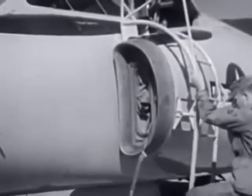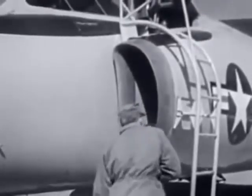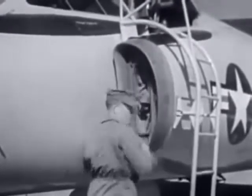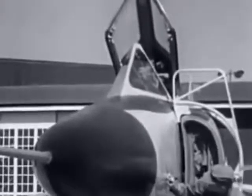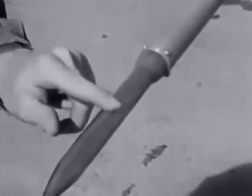The next check is at the left air intake. Pull the plug and check for any foreign objects or material in the intake. Always notice the general condition of the skin surface as you move along. Inspect the radome thoroughly for any damage or cracks, and do the same for the boom. Make sure the holes in the tip are not clogged with dirt or any other substance.